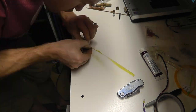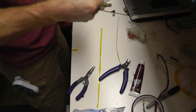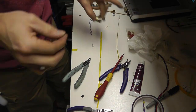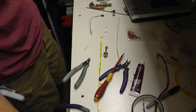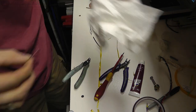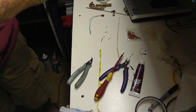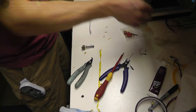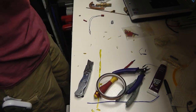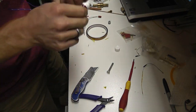That's how I'm straightening this wire because I'm going to be taping it, and now you can see how nice and straight it is. I was originally going to tell you everything I did, but I'll do it briefly. Basically I took Kapton tape and wrapped it around the wire, just one layer folded over once, and then I took this stove gasket sealer - really high temperature stuff - and used the Kapton tape as insulation. The adhesive stove gasket material is supposed to be for braided fiberglass on your oven, and I used it to keep everything in place because it hardens once it dries.